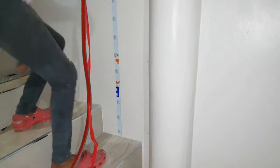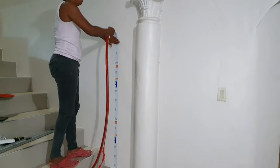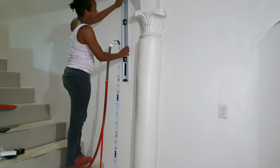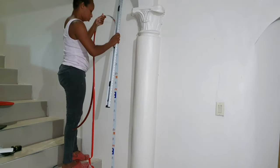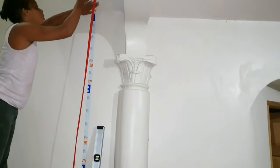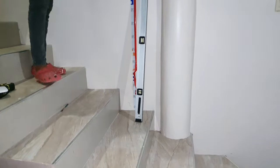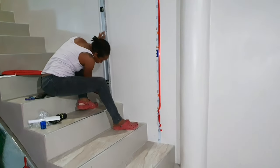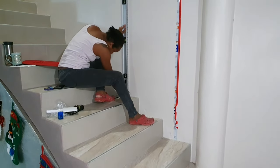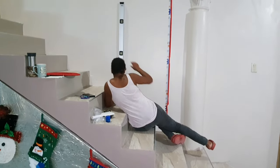Before I start with the balusters, I'm doing the metal strips on the wall of the staircase. These are gold adhesive metal strips — I've used these in other DIY projects before. I created a sideboard and I'll link the video in the description. You're not going to see the gold yet until I remove the protective film. I'm using every other step to space the strips, so it's basically cutting the strips, pasting on the wall, then peeling off the protective film.